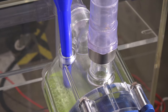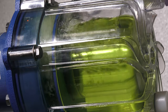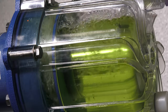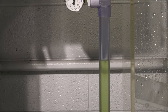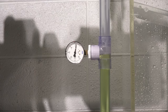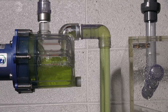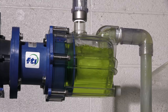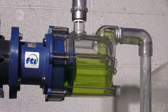It can be helpful to see this priming sequence in action. We start by initially priming the pump during installation through the fill plug. Once the pump is activated, you can see the liquid ring formed in the middle of the housing. The vacuum created by the liquid ring then pushes liquid up through the intake piping. After the pump is primed, it continues operating as a traditional flooded suction centrifugal pump. After the pump is shut off, you can see some of the liquid travel back through the piping, but enough liquid is retained by the gooseneck and the pump is primed and ready to go.